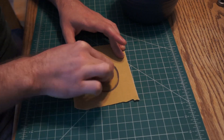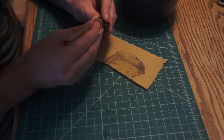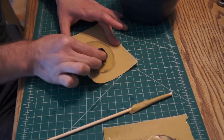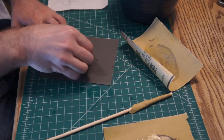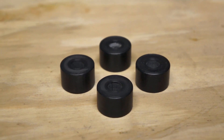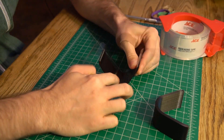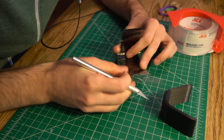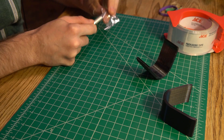I'm getting started by post-processing my prints. I'm sanding my bushing bucks and my mold base down to 600 grit. This step isn't completely necessary — you can cast good bushings without doing it — but it's going to give me a nice surface finish on my parts and a nice clean parting line for my mold. For my mold walls, instead of all that sanding, I just covered mine in a layer of packing tape, which gave me a super smooth surface for the sides of my molds. Again, this step is completely optional.